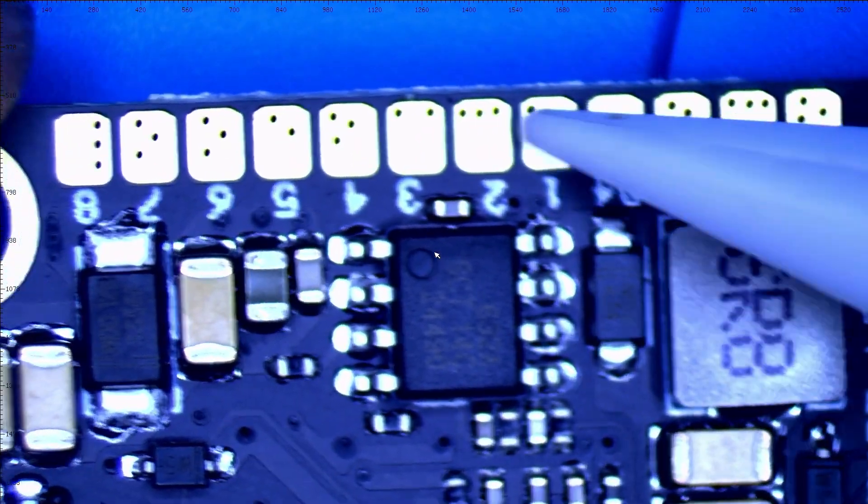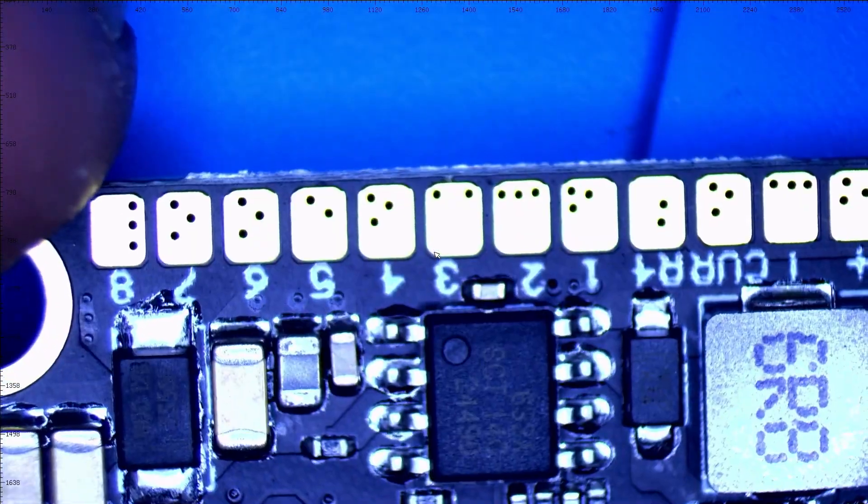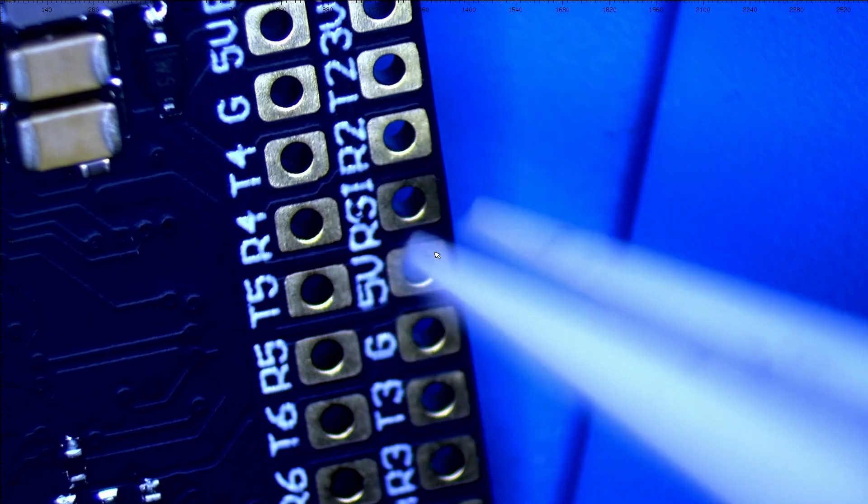Flipping the board over — if you've ever ripped off a plug and didn't know what to do, no worries. All your pads are lined up on the bottom. Even if you didn't rip it off, you might not want to deal with pinning and de-pinning two ESCs into one plug. Everything on the back — LED connections, buzzer connections, and all the rest — are pass-through pads identical to the top-side plugs, there for you to wire however you wish.